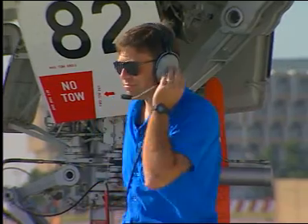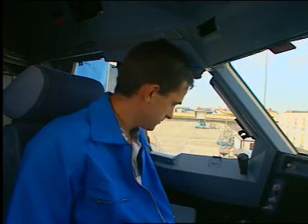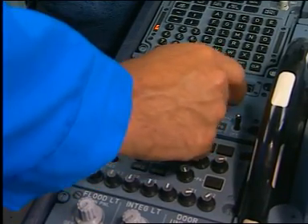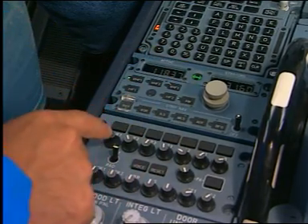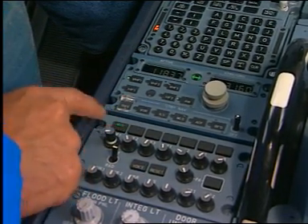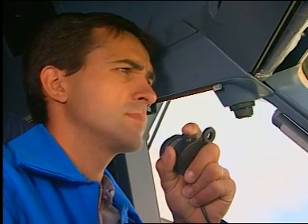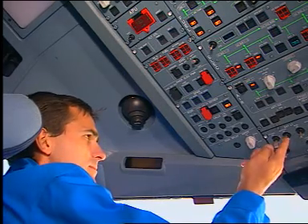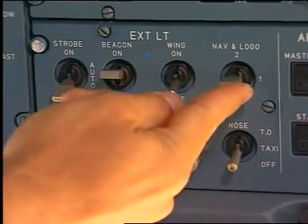Contact the cockpit so that the operator asks for clearance. In the cockpit, select VHF on the control and monitoring radio panels. Contact air traffic control to request pushback and towing and wait for their authorization. It is highly recommended to set the navigation lights, beacon lights and logo lights to on. When ready, contact the ground operator.